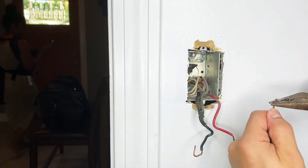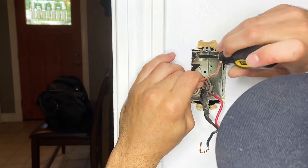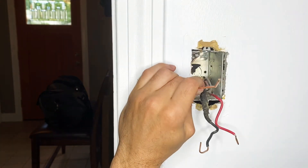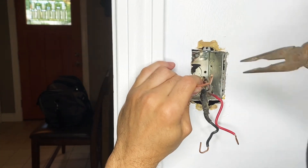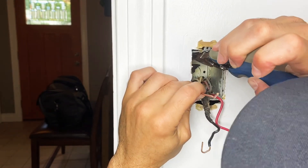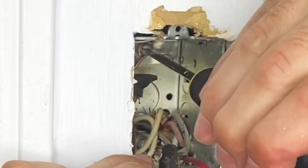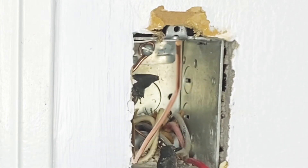In this particular box, if you look at the top there's a screw with a plate I can utilize as the ground. I'm putting a little bend in the copper wire and securing it to the screw. With my flat head screwdriver I'm screwing it in to secure it to the box, making my ground. I use my needle nose pliers to crimp the end of that copper wire, then tighten up the screw so it's locked in.